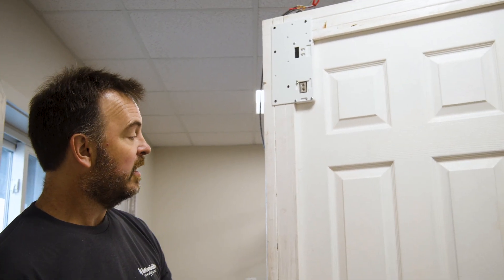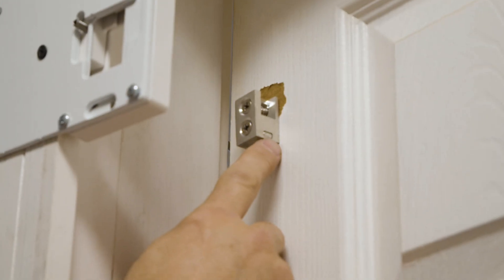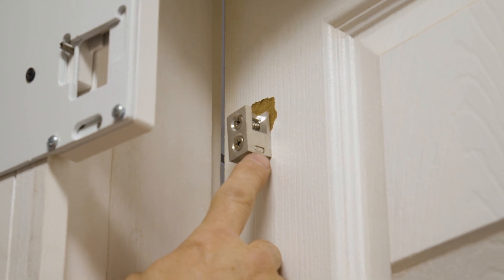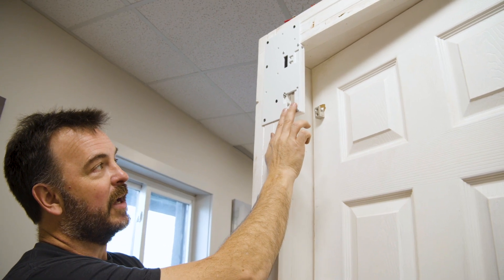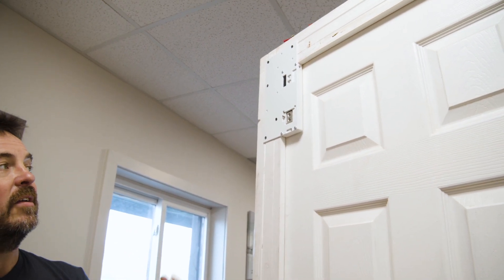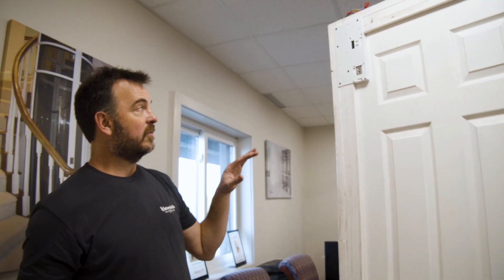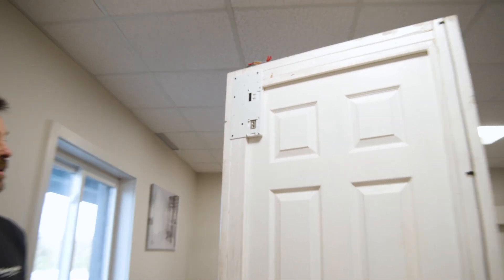I'm going to unlock this again and show you why. If you look on the lower part of this interlock, there's a small rectangular indentation there — there's actually a magnet built in there, a rare earth magnet with high intensity magnetism. That will be picked up by a magnetic sensor inside, telling the interlock essentially that the door is closed. So once I close that, it senses that and it will lock for us. If I just leave it in there, it's still going to stay unlocked for that 10 seconds until the solenoid signal goes away. But as soon as that solenoid signal goes away, it will lock and we're off and running.